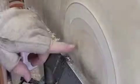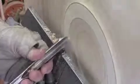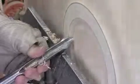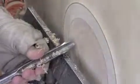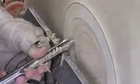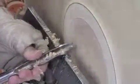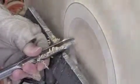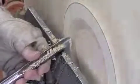If you're pulling into this and this side's higher, it's going to grab. So go to a point just before this ridge and then come back into it. Rub the bevel. And rotate your body, not your arms. Then you can bring it down.